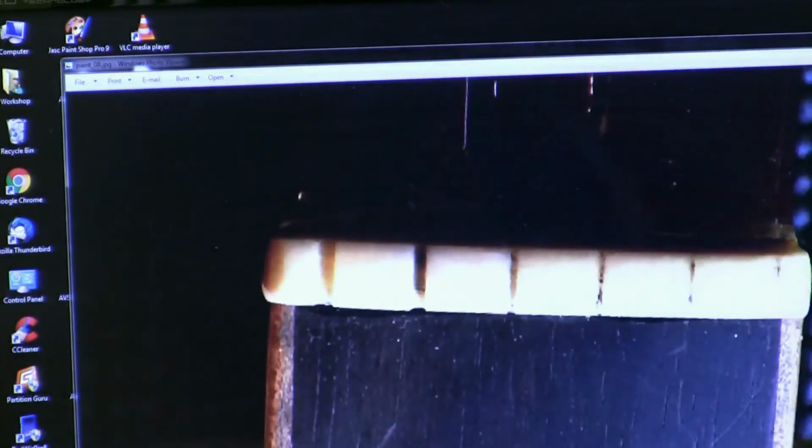And it was only on looking with Clive that we saw that if you follow the mouse here, these grooves are okay. But when it got to these, there's no grooves here. No grooves at all. Now, I'd already ascertained that this nut was cut too low, but removing this nut was going to be a problem because there was so much gloss here. We didn't want to get the nut out without smashing all this area up again and making it bad.